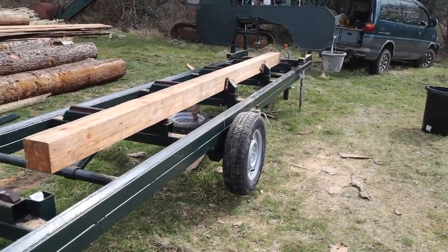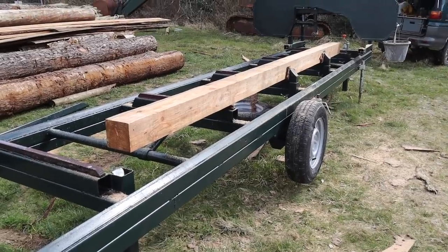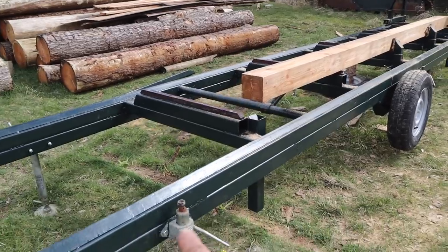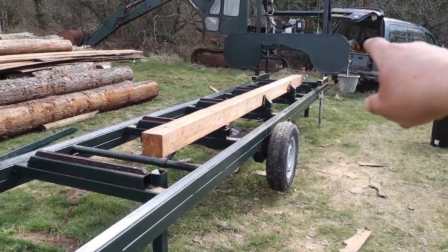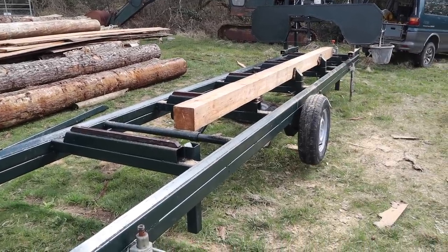But yeah, over that whole length, there's about a 3-4-5 mil deviation, something like that. So I'll probably get a couple of millimeters just on there alone. And then I can take like 4-3-2-1 millimeters off the wooden slats and correct that.